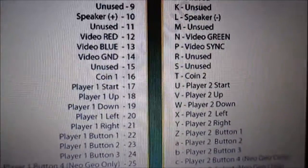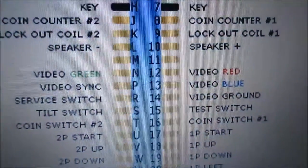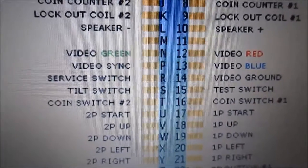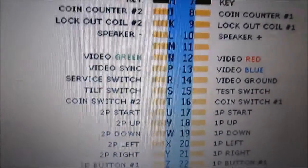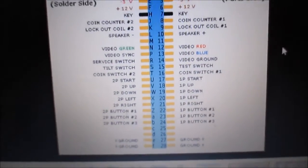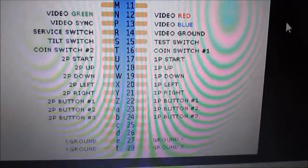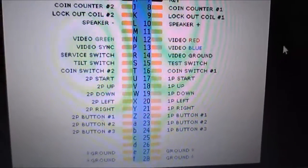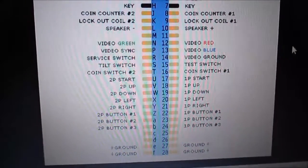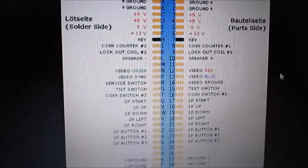You just google a different one — it's all pretty much the same. A different chart might say something different. Like this one says after the video — video red, blue, sync — this says service switch. Sometimes when you go into arcades there will be a little button you can push. You hit that service button and you can service the machine, or there's a test switch where you can run different tests, bring up a menu to change different things. So if you see something on there and the one JAMMA harness pinout doesn't show it, just look up a different one. These are all standard.